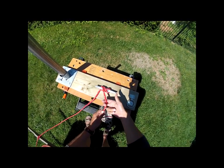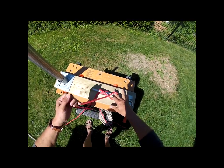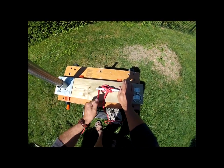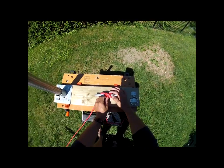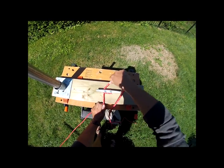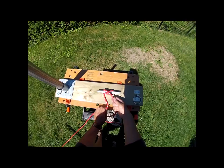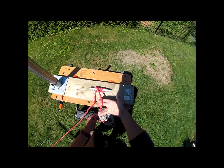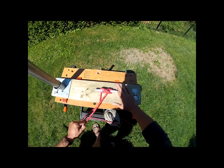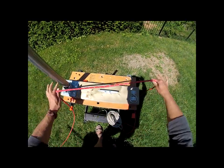To finish the cleat hitch, create a locking loop: palm up, two fingers under the rope, give it a twist with your thumb coming towards you, and you've got a closed loop where the bitter end or working end is trapped underneath. Now it's locked — the standing part goes to your boat and it is secure. Once more: around the cleat one full round turn, cross the center under the wing, cross the center under the wing, back to center, create your locking loop, and you're done. We worked with the rope where it was appropriate to position the boat at the right distance from the dock.